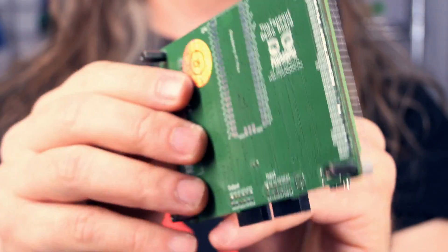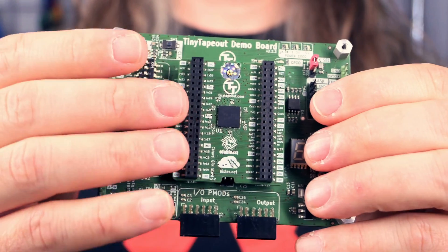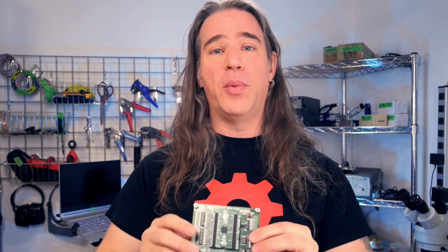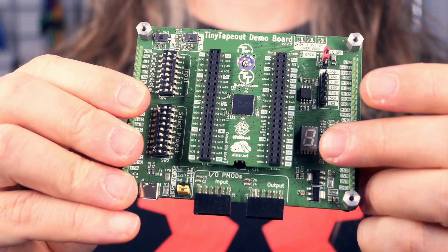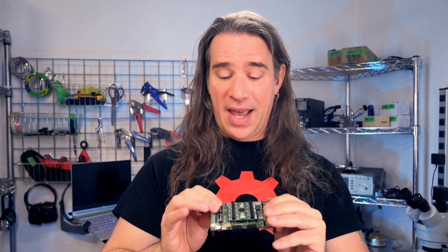So why is it that I need a custom FPGA board right now? This is the Tiny Tape Out demo board I made — it's not too bad. On top here is the Tiny Tape Out chip. It's an ASIC that you can have your own custom integrated circuits on along with everyone else's projects. I've talked about it before — it's really cool. The ASIC comes on this carrier board and you can stick it in your own projects or use this demo board, which has outputs tied to the pin headers here and the seven segment display. The inputs are also on the pin header, and you can twiddle the bits using this DIP switch and even select which project you're going to play with using this one. ASICs take a long time to make, like months and months, and we've been willing to do our dev and a ton of simulation and then wait all that time to finally see it working.